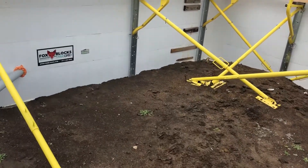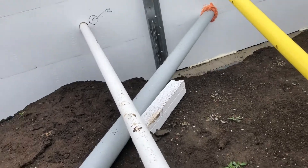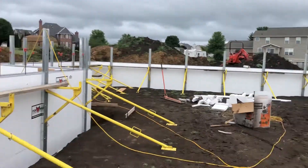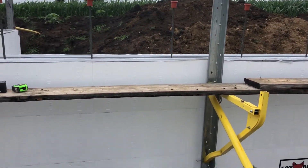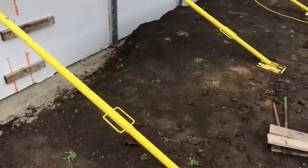Got a piping penetration about 16 feet off the back wall, and this one will be used for our gas line. Our meter is on the far right side of the house and our generator is going to be on the far left side. So we're going to have a polyethylene line running under the house to supply that with gas.